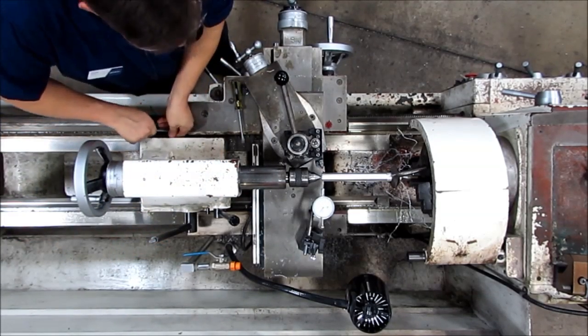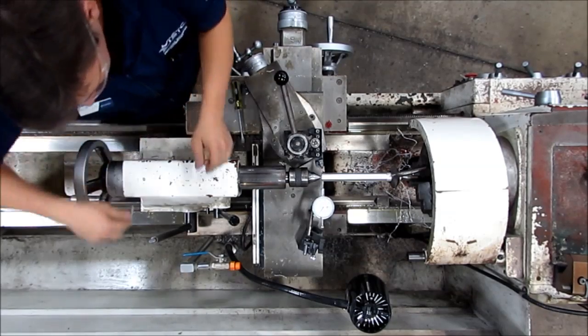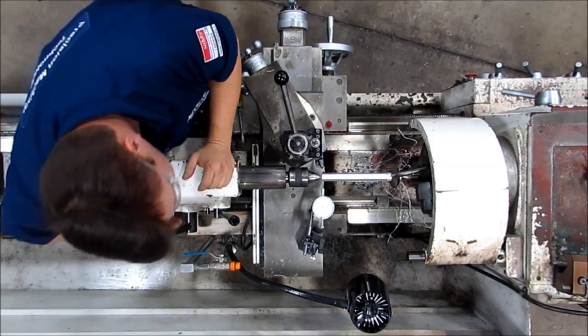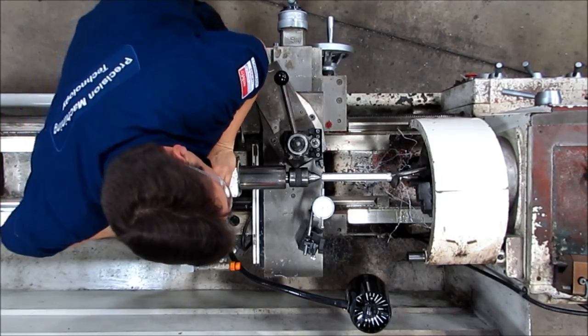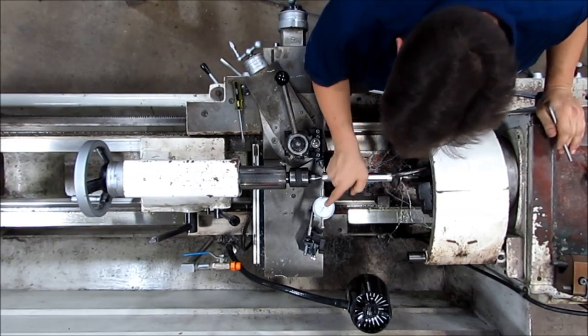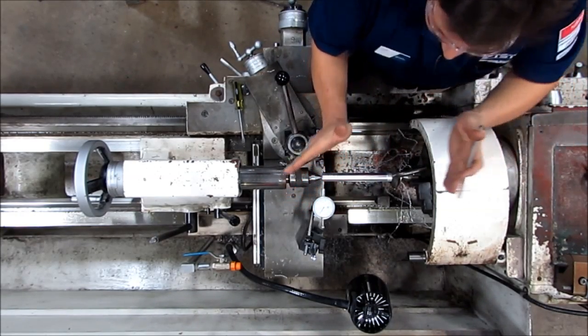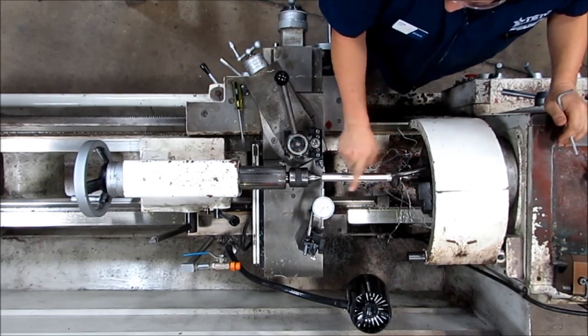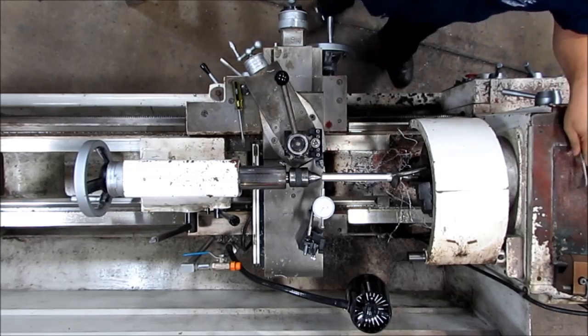And if it moves, I need to take that into account right now — and I just moved it right there. So I'm just under the six mark. That is half the total movement. I don't want to do any math, so I start from the headstock, move to the tailstock, and then adjust it back halfway.